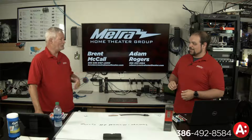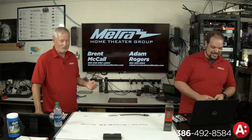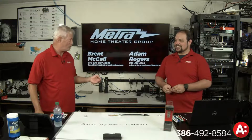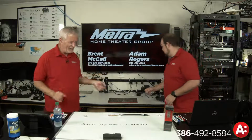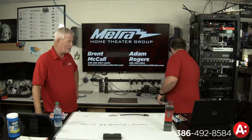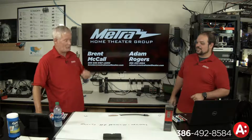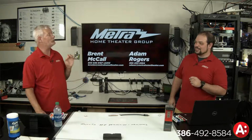Well, it's interesting because I've been talking about TMDS for 14 years now. And it seems that every time I describe what TMDS is, I use 4 different words. So today we actually looked it up. I got the correct words. My typical is transmission minimized differential signaling or system. But the correct statement is transition minimized differential signaling. There you go. Now, what does this mean, Adam?